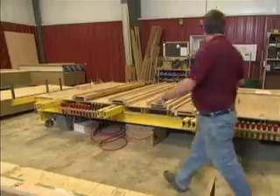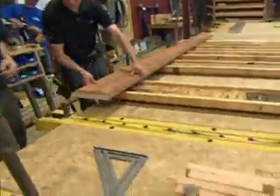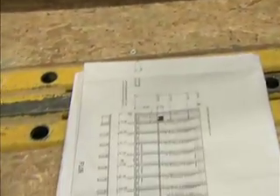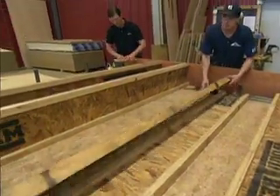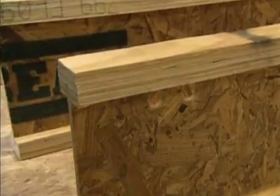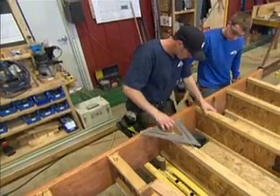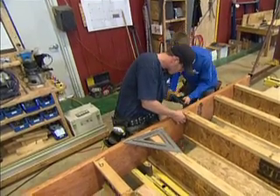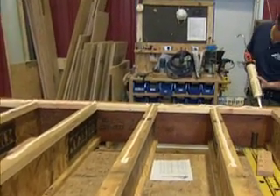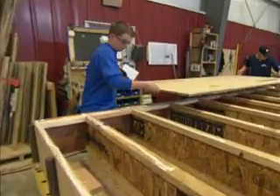We're actually starting to put together the bathroom on the main floor. Every part on this table has been pre-cut on our CNC machine. Those numbers mean the computer knows exactly where each piece goes — that part number corresponds to the part number on the drawings. Paul, I see a couple of holes drilled here. Those were drilled on our CNC machine — they're for the radiant floor heat, so the computer knows where the radiant heat is going to be run even before the floor is assembled. Now we're getting ready to put down the OSB sheathing. That bead of adhesive underneath the subfloor locks down the OSB and stops any squeaks that might happen later on. We take the subfloor, line it up with the rim, and nail it off.